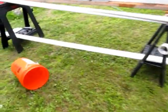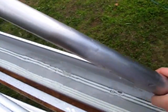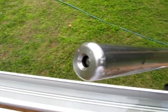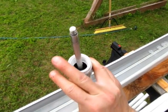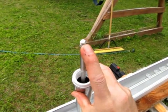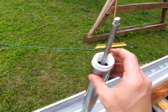Over here, this is the business end. This is the actual pump. That's what's going to be all the way down at the bottom. We got this in the chlorine solution. Drain that off. It's got a ball check valve down that end. And here at this end is the sucker rod, and the water comes right up around the sucker rod. And that's how we do it. This threaded connection here is where the drop pipe is going to go. Sucker rods will go on here. You just drop it down in 10-foot sections, and it's just that simple.